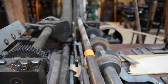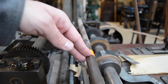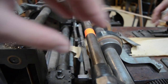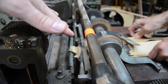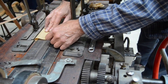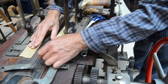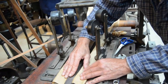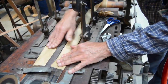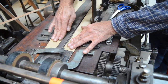So in order to make it a bit safer, we've put a piece of tape right up at the edge of where the blade goes. When someone's engaging the paper bar, they put their hand on this side of the tape and their fingers won't get cut off by the blade. I guess it stops here. And then these rollers on levers lift up so you can feed it in — they get set back to keep it in place. But as you can see, they do fall forward a bit, so loading it is a bit cumbersome.